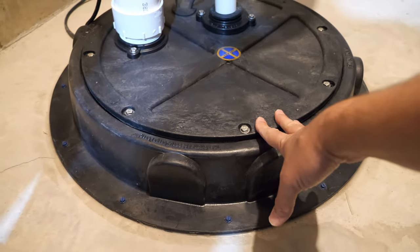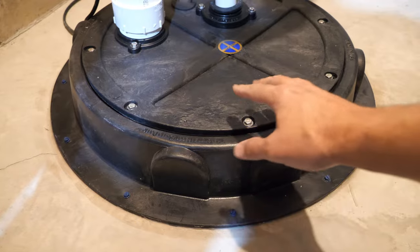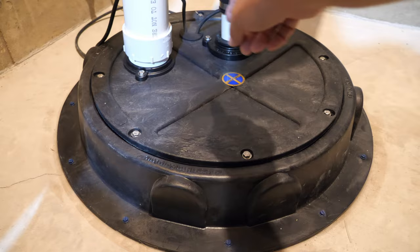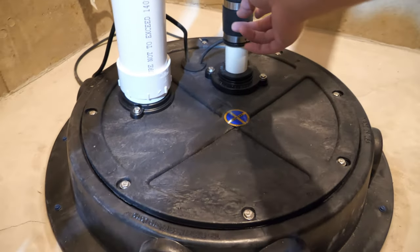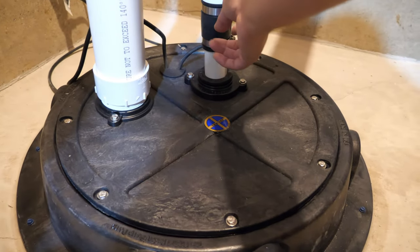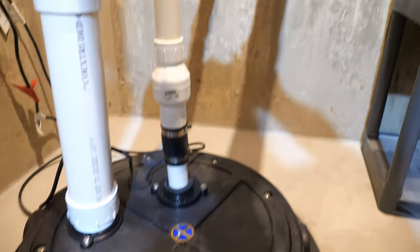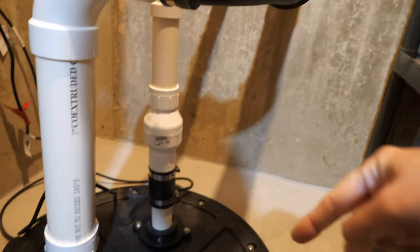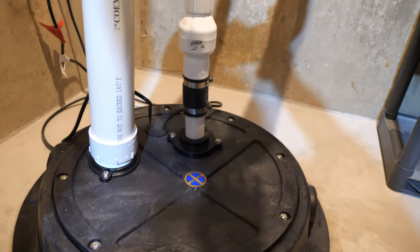This is over the crock for the sump pump and is sealed down with silicone to keep a nice tight seal. It has a rubber connector — a 3-inch screw-in PVC connector — and a rubber fitting that the pipe goes through down for the sump pump. I put a coupler below the flow-back valve so it shouldn't leak. I also put a rubber connector here so I can remove these two rubber connectors and fairly easily get the crock top off without having to cut any pipe.